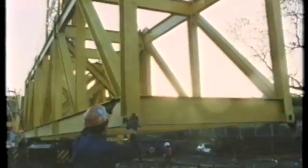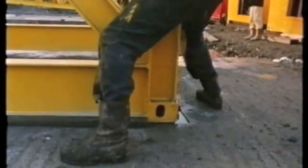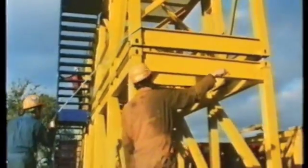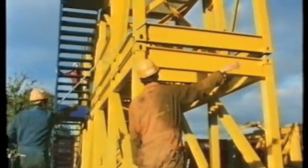The initial excavation was secured by the concrete lining and, once the rig slab was complete, the erection of the rig could go ahead. Prefabricated units of the Titan rig and its substructure are assembled on site by a team of eight men and a crane of 130 ton capacity, the whole operation taking two days. Accurate location of the unit is essential to ensure the rig lines up precisely over the foreshaft.